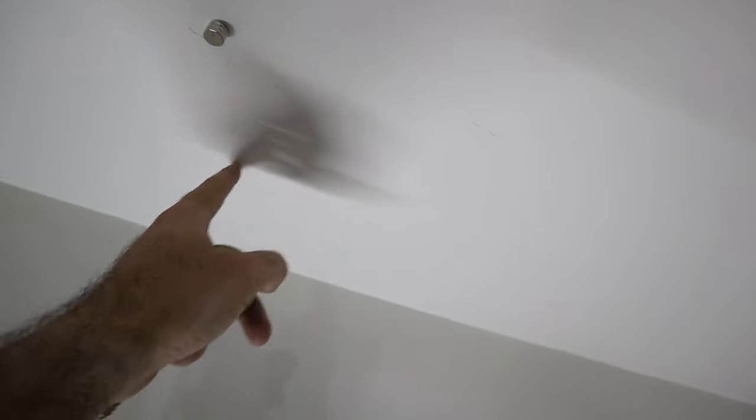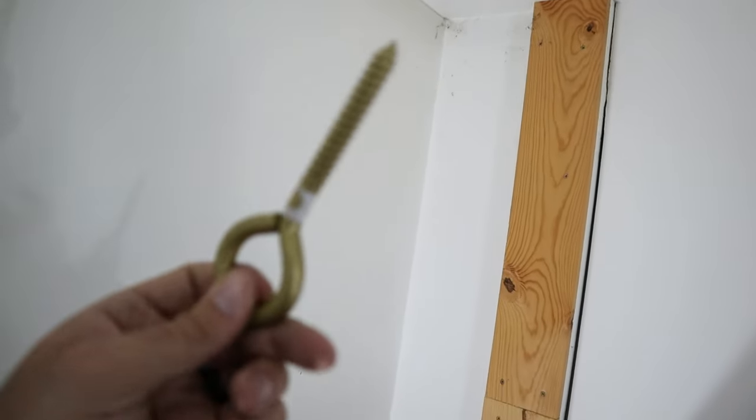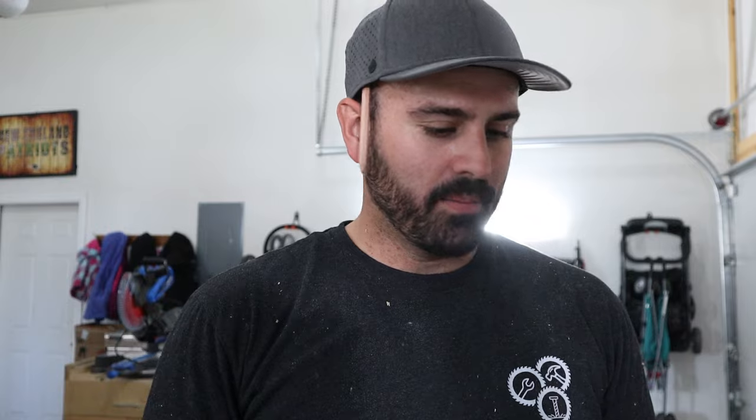I figured out what I'm going to do. I have a stud running this way, so I'll line up the frame with that stud all the way back. I found these eye lag bolts — I'm going to put four of them up into the ceiling, one for each corner of the frame, and also a few eye bolts on the frame itself so the chain has something to connect to. These hooks are also perfect for hoisting — I'm going to hook a rope up to them, tie it to the frame, and hoist it up so it stays supported and level while I drill it into the wall studs.